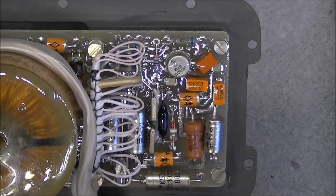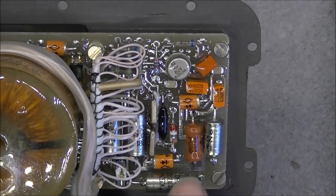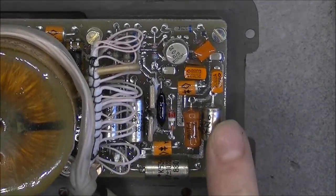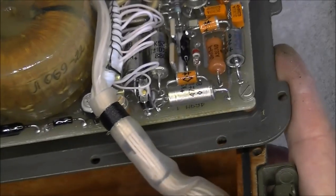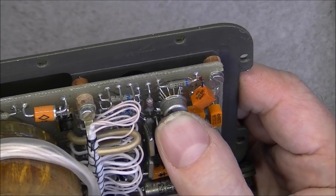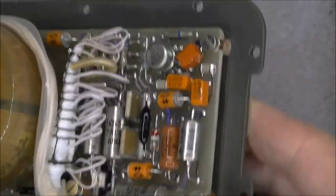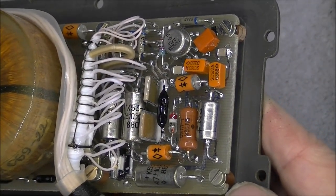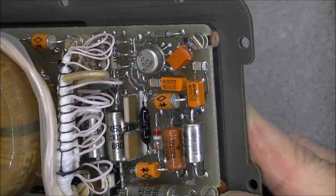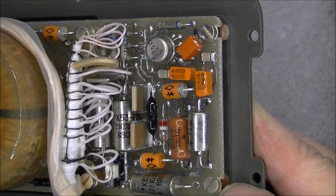These orange things here, they are diodes, I believe, but not the models you see every day. Here you have regular red Soviet resistors, regular mil grade hermetic capacitors, some probably op amp here in a can. These are not common, seems to be ceramic multilayer capacitors like SMD capacitors, but mounted on the side with legs and actually mounted through hole. Not something you see every day. I believe it is the first time I see it in Soviet electronics.